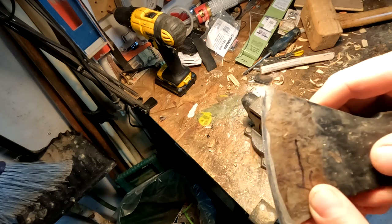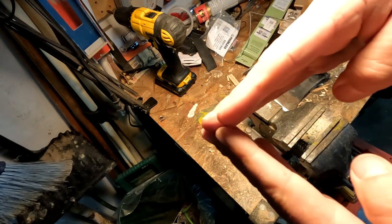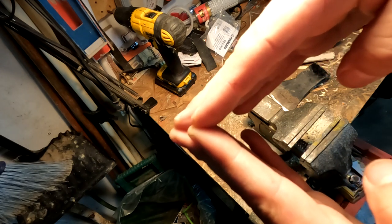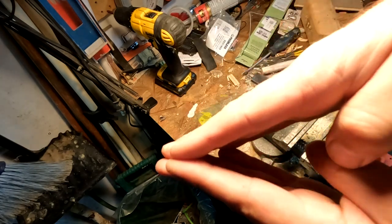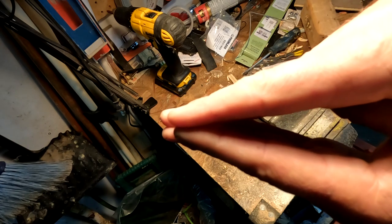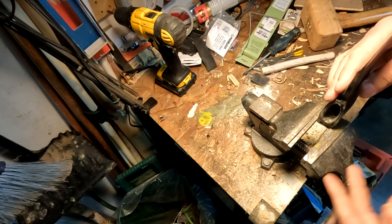You can use machines for that too. I've got this axe pretty much the way I want it. The trick is a lot of axes profile the blades bluntly, and that's good because it makes it hard to break, but it's not good for cutting wood. For little hatchets like this, you don't want them blunt — you kind of want them sharp. You don't want them to have the profile of a knife, but you want them sharp so you can do finer tasks.